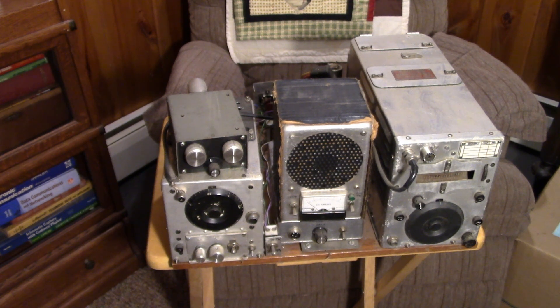The receiver and the transmitter are not stock. I'm not running it like some people have in mobile operation, where they actually collect all of the proper cables and trays, run it on a dynamotor, and put a couple batteries in the trunk to run the whole station with big heavy cables through the vehicle. I wanted something that I could mount on a piece of plywood and carry it out to the car, just lean it on the front seat, hook up the power supply, and be on the air using the car's regular 12-volt power system. This is an easy in, easy out type station for 75 meter AM in the vehicle.